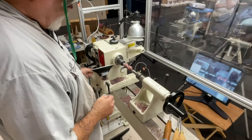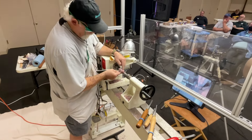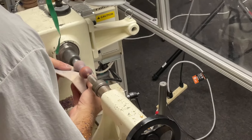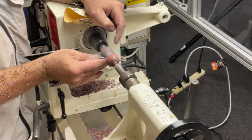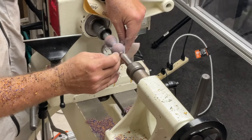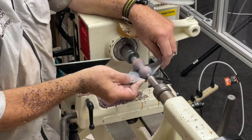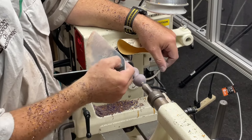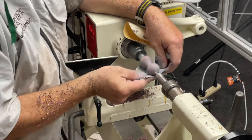At this point I can start to sand. I'll slow the speed down a little bit. I believe this is 240 grit. I'm going to try to get in underneath that cap and blend in the spaces. I could remove that little nub and the tailstock, but I am pressing on this wood a little bit and it's holding on with just the threaded mandrel — I'd rather keep it up and just do a little finish work near the end.